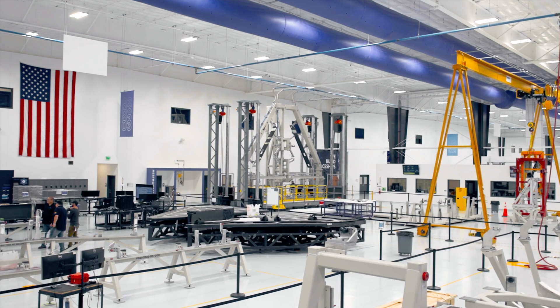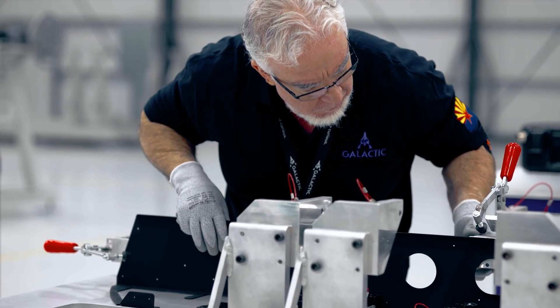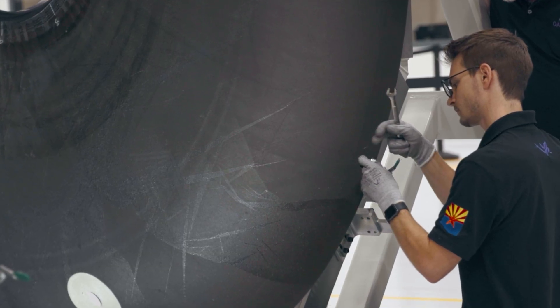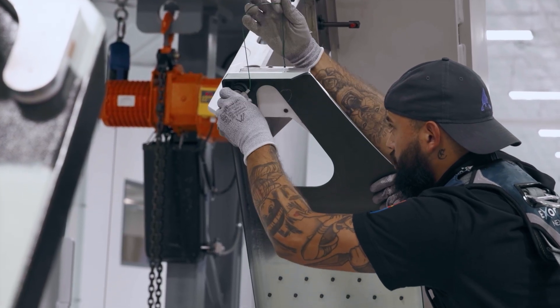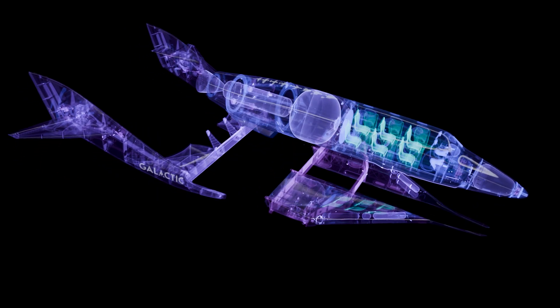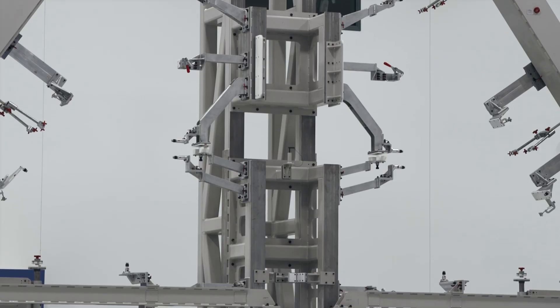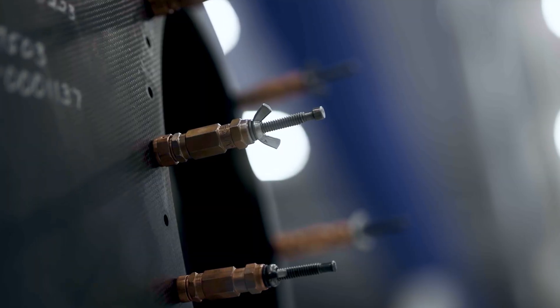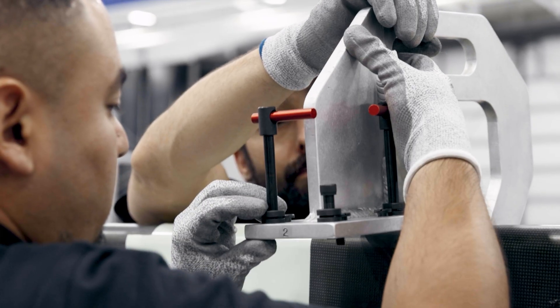For the Delta program, we invested heavily up front in precision assembly tooling, and this investment has led to a higher quality build. It's safer for the technicians from an ergonomic standpoint, allowing them to go right into the build with those determinate features — something we call determinate assembly. Determinate assembly is where the design and engineering of flight parts integrates features that allow us to index easily into assembly tools, which then allow us to put other sub-components onto that flight part quickly and efficiently. It creates a real, smooth build.